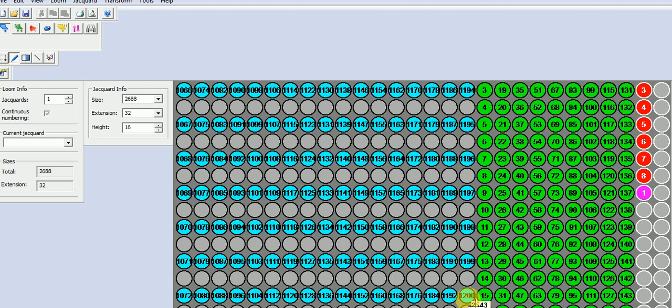1200 means actual total number of hooks of this design, this jacquard, is 2400 for body, but we are only taking 1200 because our fabric has only 84 ends per inch. That's why I will leave one after one. I am taking this hook for thread, and this I am keeping empty in the jacquard loom. This is how you can tell your drawing people, they will understand and draw like this.